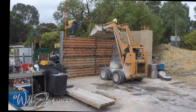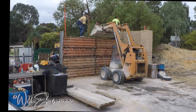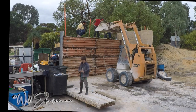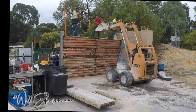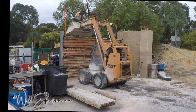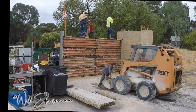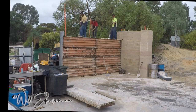As you can see, they're putting in what we call wall pins. There's a video for wall pins — it's a long pin with a plate welded to it. The plate goes underneath the mud, the mud goes on top, and the pin sticks up the top with a threaded section so you can bolt your bond beam down.